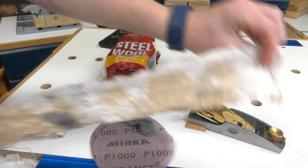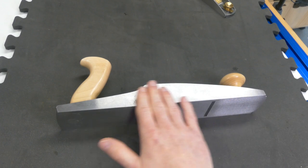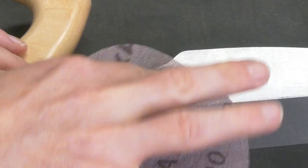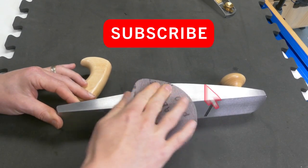With your Step One and Two, make sure you've got a different piece of rag for application and then some cleaner rag to wipe off the excess between uses. Here is my number five jack plane, and as you can see it has got the beginnings of rust on the side. We're going to remove most of that rust with the 600 grit — this is where you have to do the bulk of the work. I go with the milling marks so I don't introduce any new scratches.